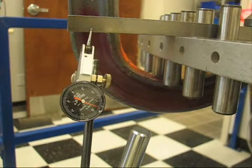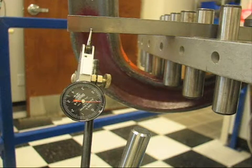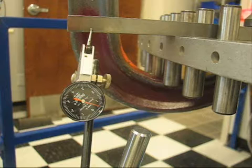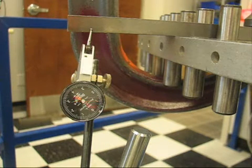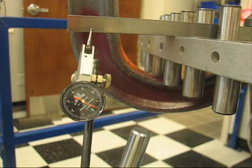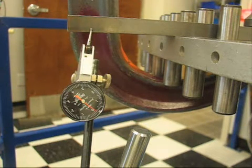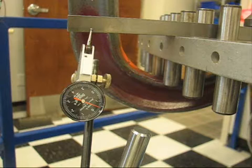Lastly, the DDR motor's ability to make very small moves is demonstrated. As you can see, the motor is making 1/10,000th of an inch moves. Keep in mind that each move is 1/16th of the thickness of the Scotch tape. A hand on the load wheel cannot detect this movement.